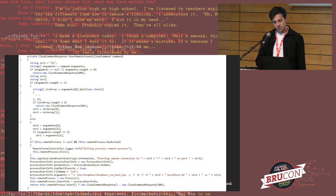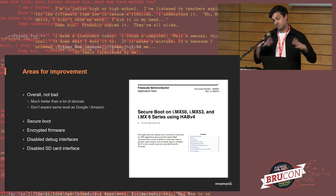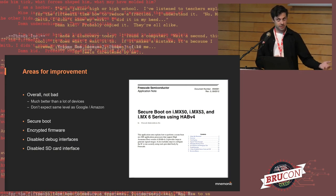Overall, it wasn't terrible — actually much better than expected for a startup's first product. Key recommendations: implement secure boot so custom bootloaders without signed firmware would be blocked; encrypt the firmware on the NAND flash so we couldn't read the device tree; disable debug interfaces like the UART port; and disable booting from SD card. Small fixes that would have significantly raised the bar. With that, thank you.